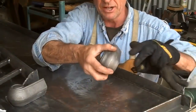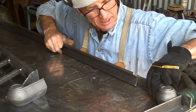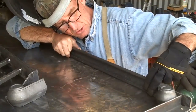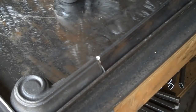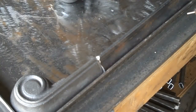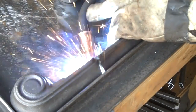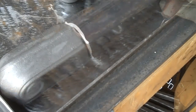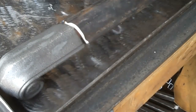Okay, after we've got these ground down, we're just going to use this angle iron that I've got set up here on my table. Line this up right here into this corner. Make sure it all lines up nice and straight, and then it's time to weld it out. Here you can see we've got it all lined up. We're just going to tack it before we weld it off. Double check it — just use a straight edge of some type. Not too bad, I think we can go with that.